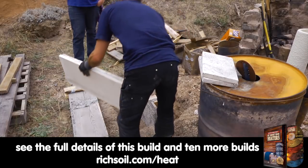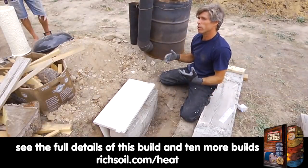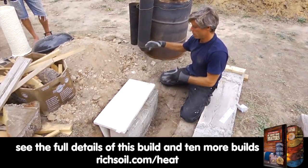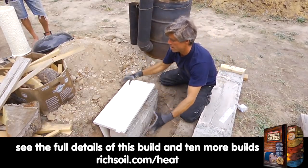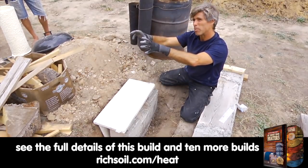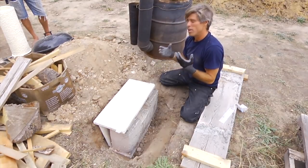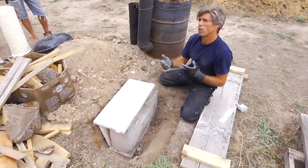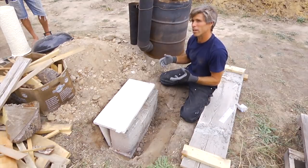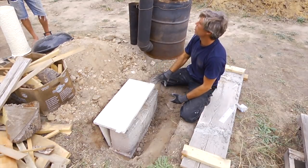This is more insulation. You burn the fuel entirely, and we do that in a way that it's insulated so that the heat stays and burns all the fuel. By the time it comes out of the top it's pretty much completely burned and hasn't lost any heat. Once we've burned all the fuel we can harvest the heat, and the best way to burn all the fuel is to have very low mass in the combustion chamber.